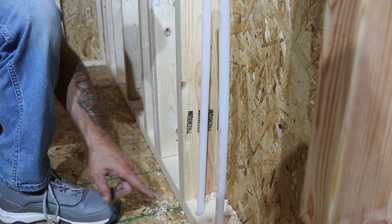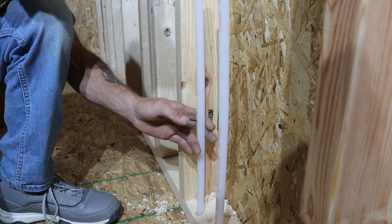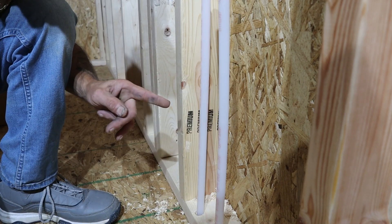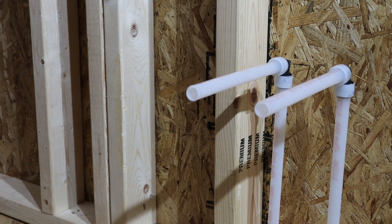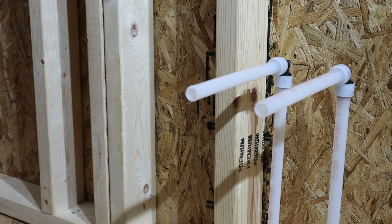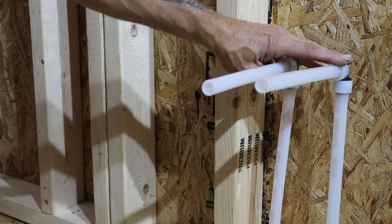We made a decision — took a chance to drill the holes down through here inside the wall and drop the two lines down. Remember underneath here has another beam just underneath it. I had just enough room — I'll show you when we get back underneath there — to slip and bend those pipes back so I can get access to the main water lines to tie into. Let's go ahead and put a couple of 90s on here and stub it out with a couple pieces. Now we've got two water lines stubbed out for the kitchen — left is hot, right is cold. This will be all set and ready to go. When we get the cabinets in here we can just drill holes through the back and these lines will come out looking really nice.